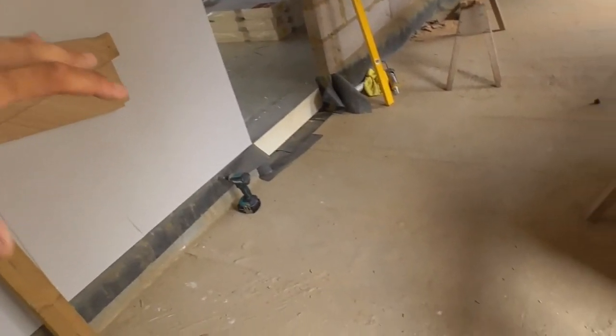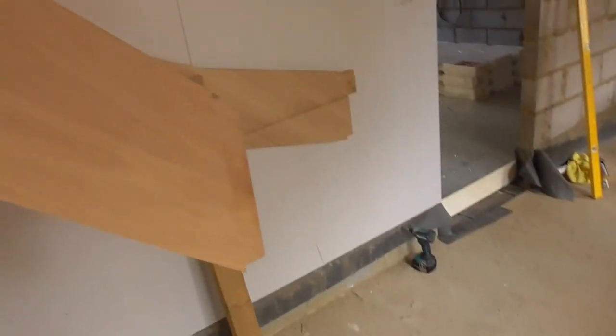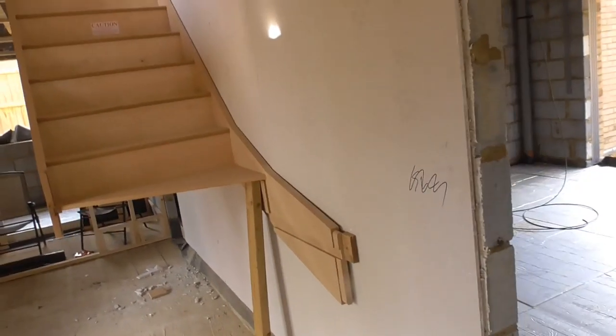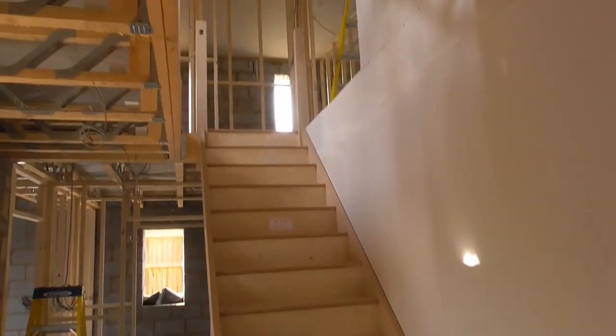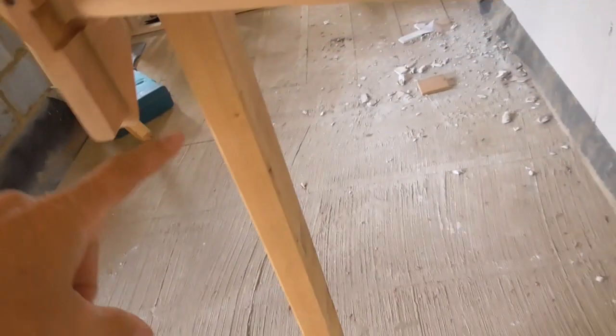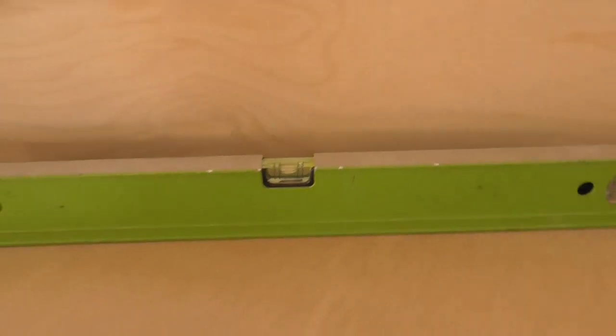What we can start to do now is build up this bottom section and put these where it starts to turn and come down. I've now measured it - 1736mm - and it measures from this tread here to a level line I've put just up there, so we know that's exactly right. When I put the level across here you can see that reads right. I've also put a small prop in this end to level that across so that reads right as well.